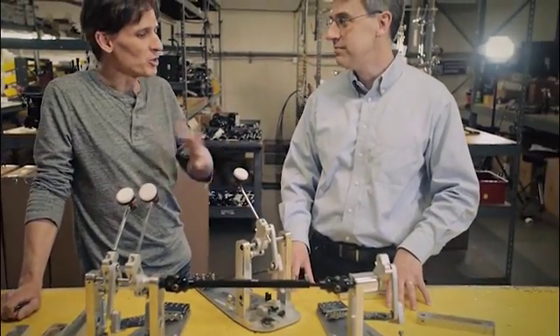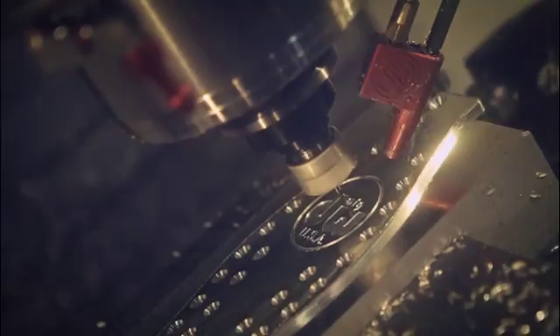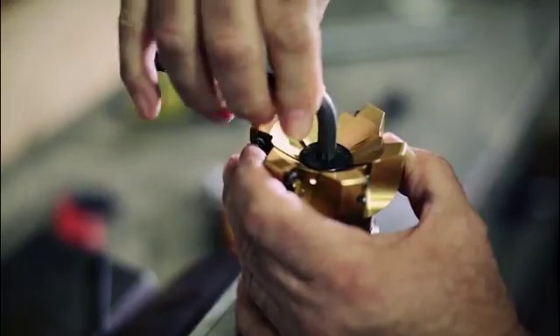Talk about how cutting tools have changed. Well, with the cutting tools, I started looking at just surfacing the material, taking off the bulk amount of material at one time, and mostly using end mills. Then started looking into other tools to figure out better, faster ways to remove the material. Got into shell cutters, got into insertable shell cutters. Amazing how it cut my time down.